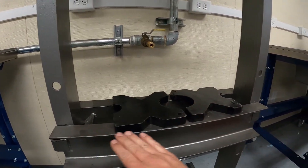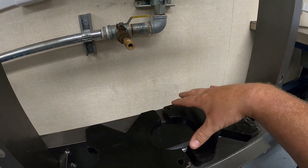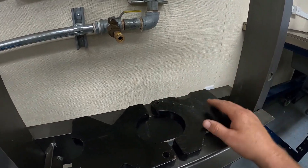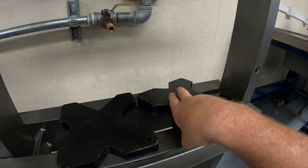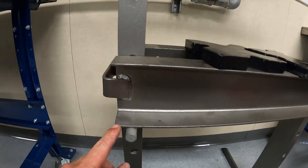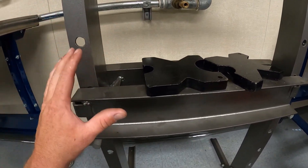We have the work deck down here. The deck is basically a girder and we have two plates that can be oriented in a couple different rotations to allow for different shapes or different components to be placed in them to be pressed. To lift this deck up and down we have a series of pins and some handles. You want to clear the deck completely off when you lift it to get it to the right height.